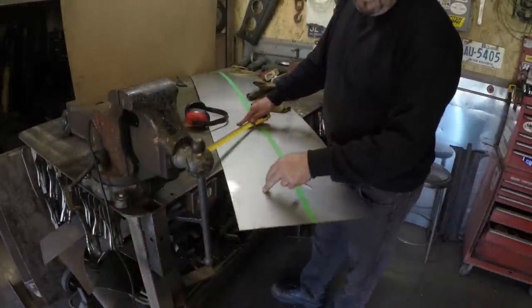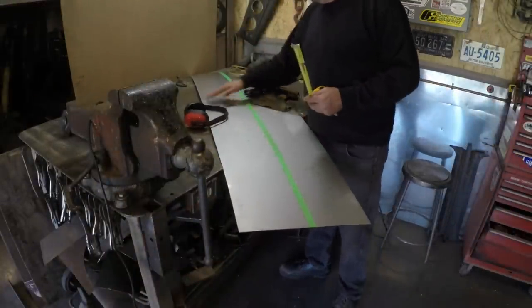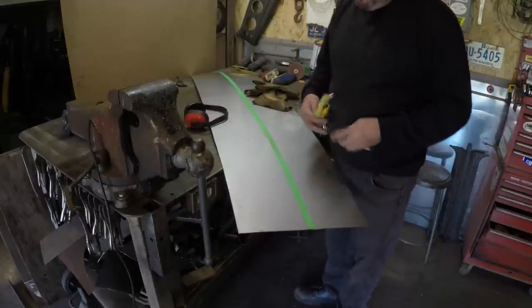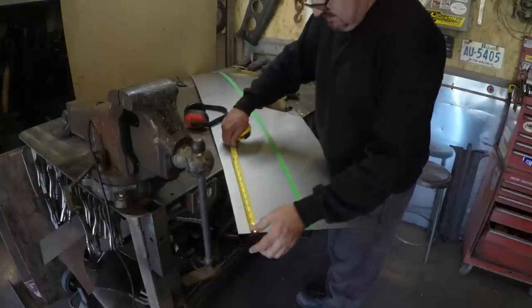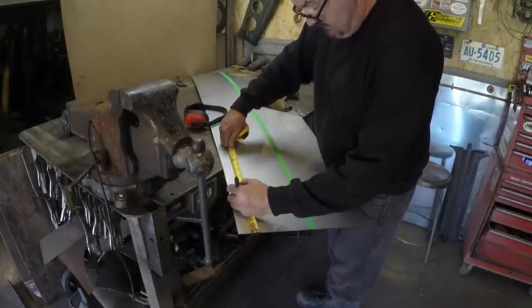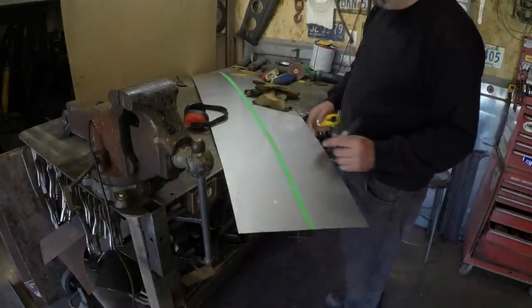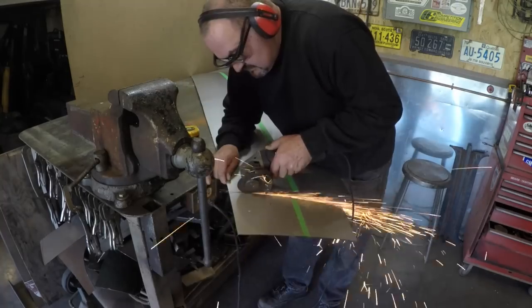The trick to always start with when you're doing this type of hood is to always have a square piece to start with. And always take your measurements precisely off it, because as you make things smaller, if you just rough cut stuff, it'll throw everything right out of whack. So I'm just gonna take off 6 inches here now and see where that falls for me.